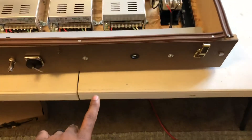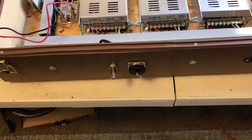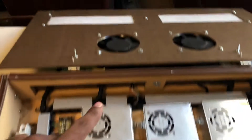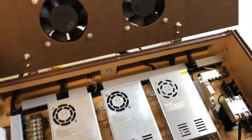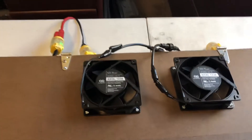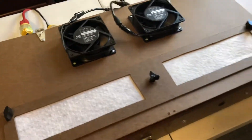On the bottom, I have a 10-pin connector, which is going to be the power supply for all the drivers — so the four drivers and then the offline controller. This other one is two lines of power, which will run to my controller enclosure — the brains — and have the other two fans for cooling. These fans do move some air in normal circumstances; I don't think they're meant for this type of application, but that's why I have two. I also decided to cut holes and add some filter material here to try to keep the inside of the box a little cleaner and cooler.